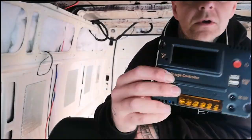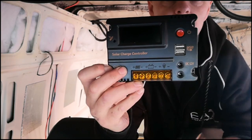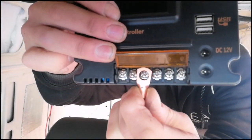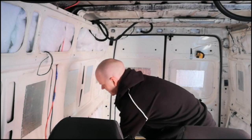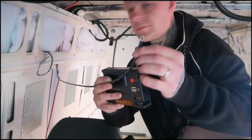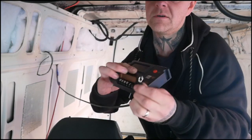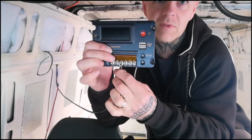With the solar panels I've got the solar charge controller, and with it you get these clips to go onto the wires but they don't actually fit. So what I've had to do is twist the ends of the wire into two separate parts and then twist them round so they then slot around the screw hole. Fantastic — that works well.